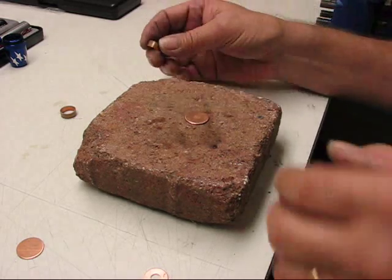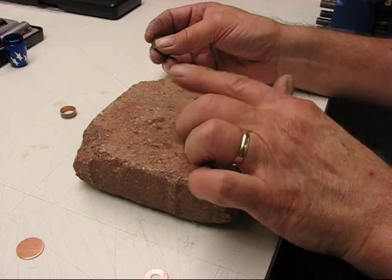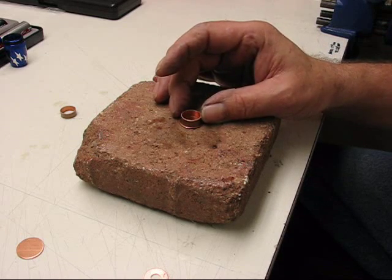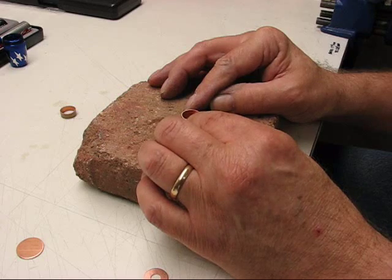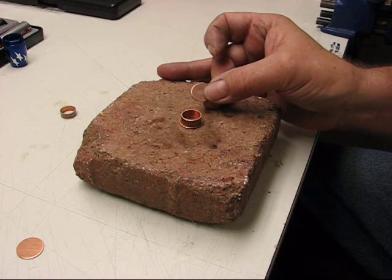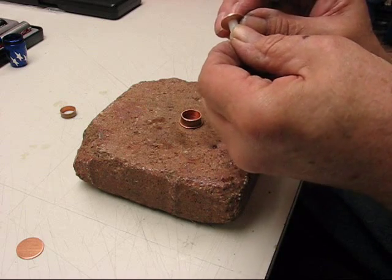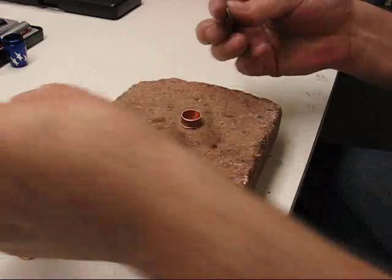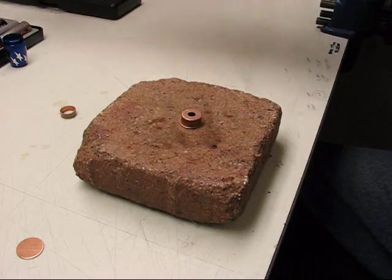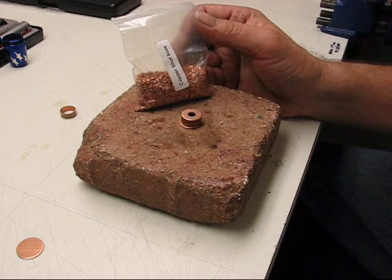The bottom part of the heat sink is ready to be assembled. I have the 3/4 inch copper round, and I've cut a piece of tubing to 5 millimeters thick — that gets centered on the round. The bottom round has been drilled so the plastic extension can be seated into it. Once it's all together it'll be filled with copper shot and solder, so I'll go ahead and fill it up, solder it, get it smoothed up, and show you after it's done.